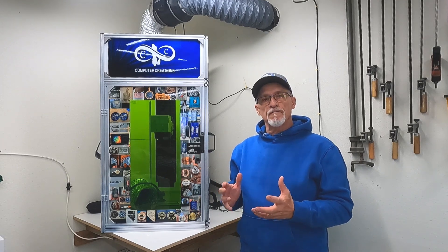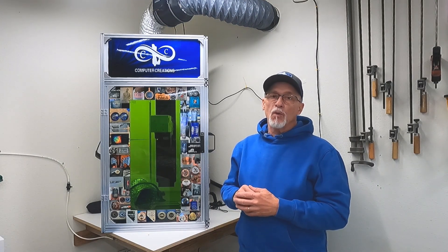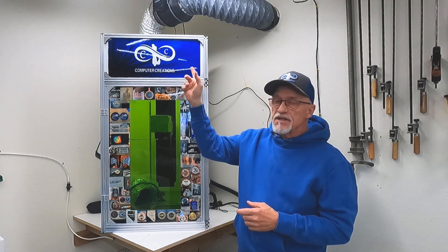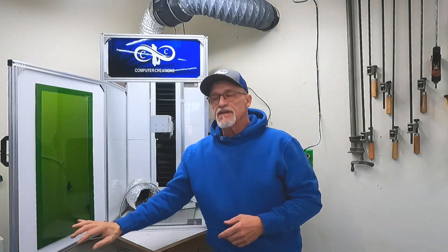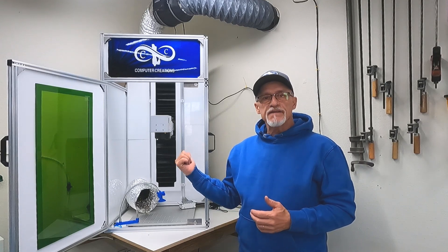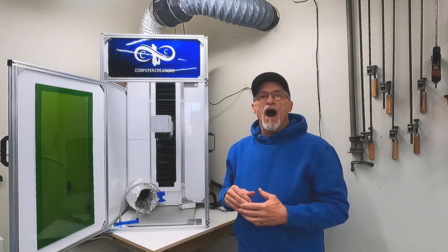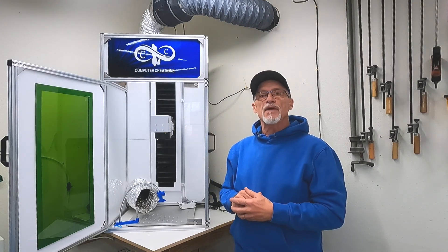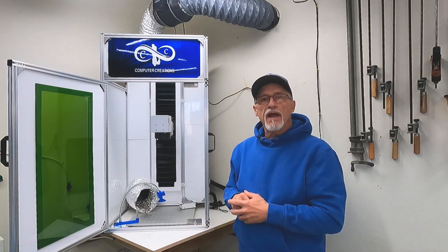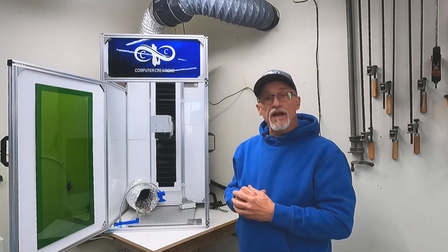One of the first things I'll tell you is I had an older fan from my old diode laser that wasn't quite up to snuff. What I did was add a six-inch Infinity fan, and I can tell you that seems to be just right. I've run six-inch duct all the way into the cabinet and it seems like the six-inch will pull just about anything I need — whether I'm engraving coins, burning leatherette, or whatever. It evacuates any fumes or smoke from the cabinet with no problems. I know several people with the four-inch fan who just don't seem to have enough. I'd recommend getting a six-inch fan if you get a fiber.